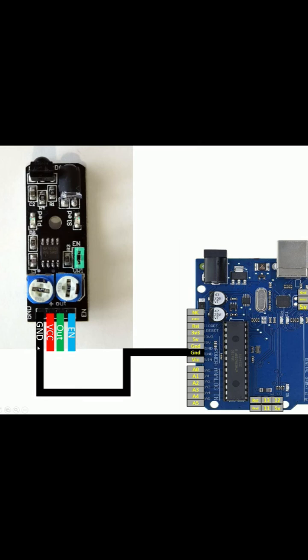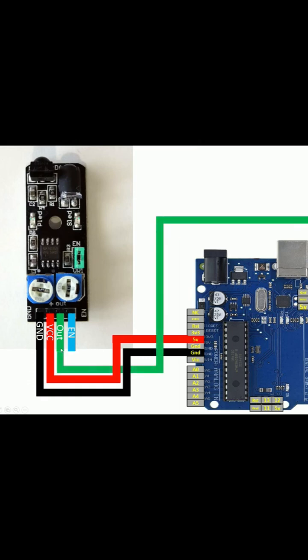For the wiring: connect Ground to the Ground pin of your Arduino Uno, connect VCC to the 5V pin of your Arduino Uno, and for the output pin you can use any available digital input/output pin — I'm going to use pin number 7.